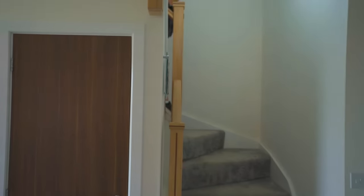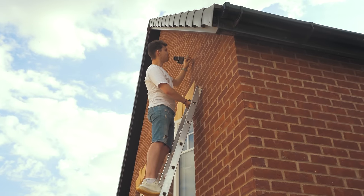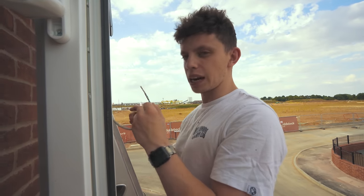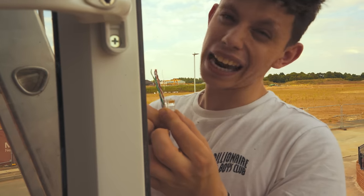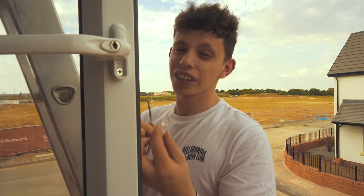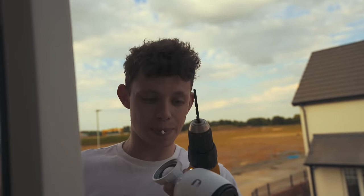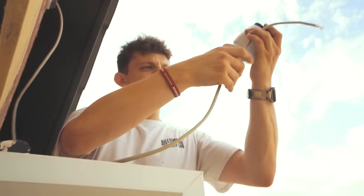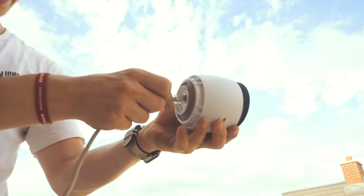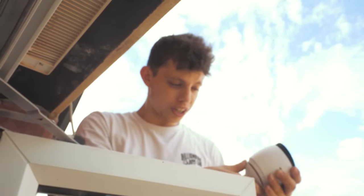Alright mate? Ready? Yeah, yeah, yeah. So there we go guys. Lucas has been hard at work already pre-running some of the cables. As you can see, the cameras will literally sit right here, nice and flush. This is just essentially normal Ethernet cable and, like we've done in previous videos, I'm going to put this Ethernet end on here — that is essentially just an Ethernet cable that's going to plug into the camera and supply power and data transfer. So I need to drill two little holes and mount this camera. Hopefully it's going to be that easy. Awesome! That ain't going anywhere. You run the cable through there and then that just clicks into there like that. And all of this, by the way, is IP68 water resistant, so we should be all good keeping these things outside.